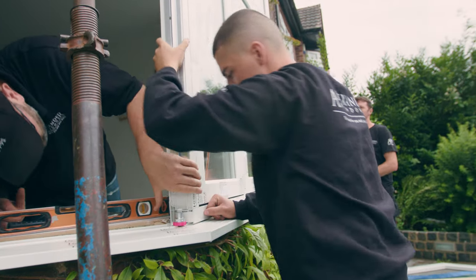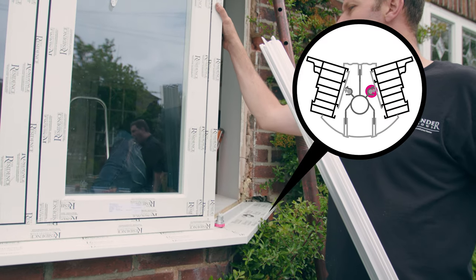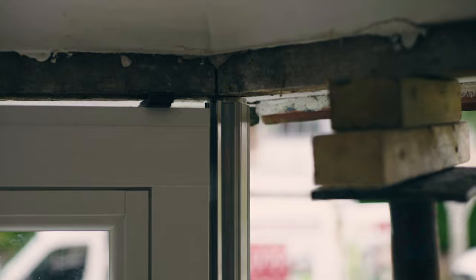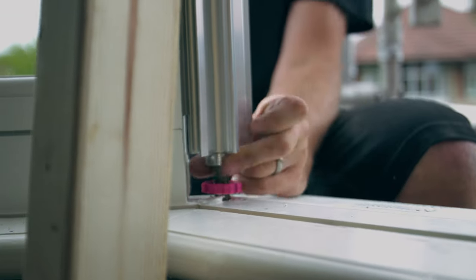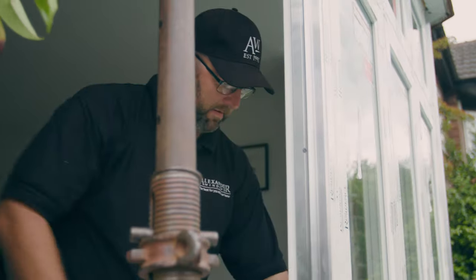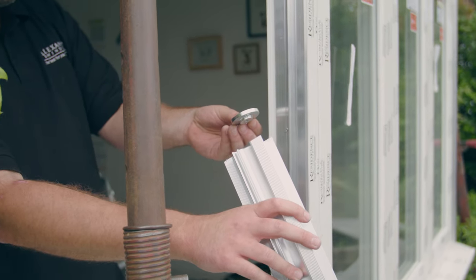With the central facet in place, position the bay poles either side, ensuring the ball sockets are fully engaged. Locate the top spreader plate into the hole of the bay pole and position. Now begin to jack the pole until the bay starts to take load. Don't over tighten — you're aiming to simply take the weight.